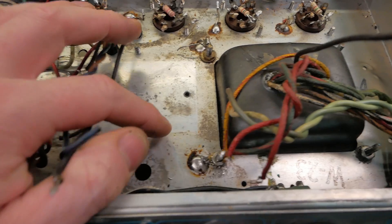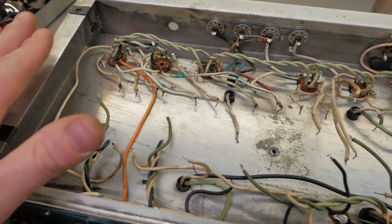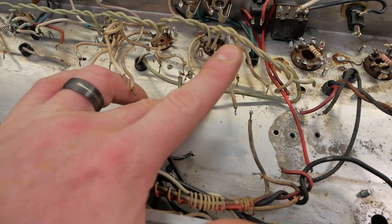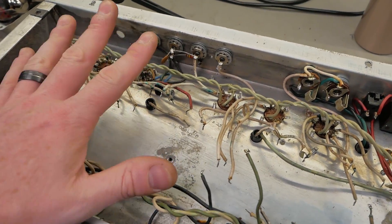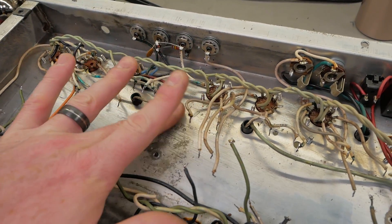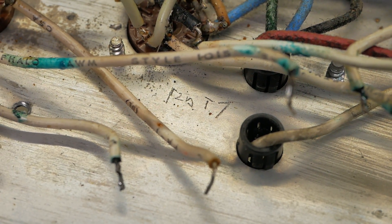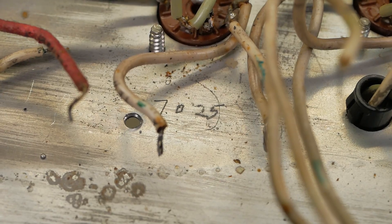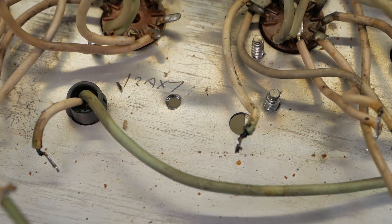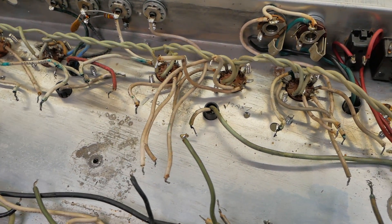We'll solder the grounds directly to the chassis at a convenient nearby location, usually in that gap down there. We'll clean the chassis under the existing wiring as best we can to get rid of the waxy residue - I can feel it all over the chassis. As the amp heats up and cools down repeatedly, the wax spreads across the entire chassis, gathers dirt and crud, and becomes sticky. We'll clean all that off with shellite. Also - I never understood why someone felt the need to write the valve type on the chassis. If you don't know the basic structure of an AB763 or can't refer to the documentation, you shouldn't have your hands in there.